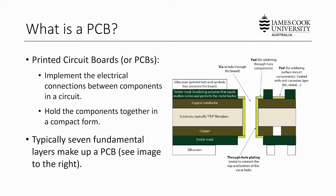There are typically seven fundamental layers that make up a printed circuit board. Let's have a look at the image to the right. Working our way from the innermost layer to the outermost layer, we start with the substrate, typically FR4 fiberglass. The substrate provides mechanical rigidity to the PCB and it also insulates the device from heat. The next layer is a thin layer of copper that surrounds the substrate. The copper is typically patterned into a series of tracks that connect the components to one another to allow electrical connection to exist. These copper tracks are created using an etching or milling machine.